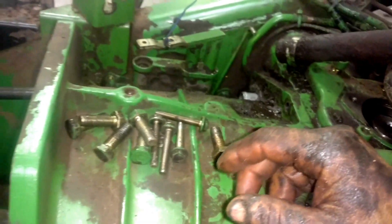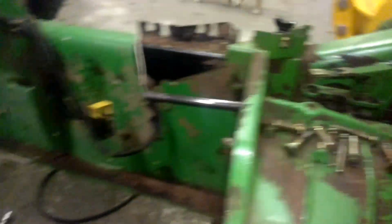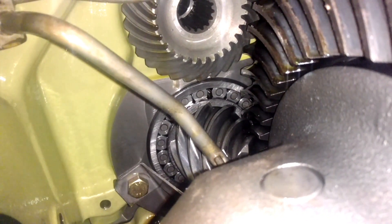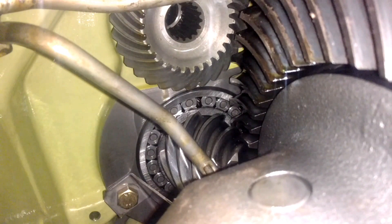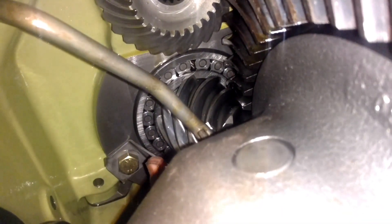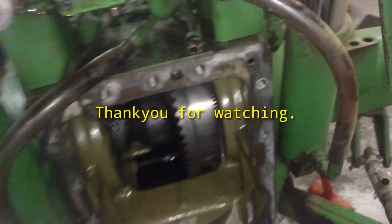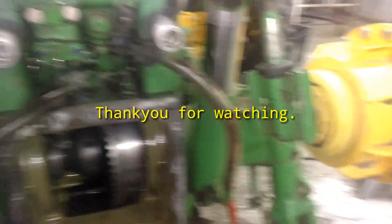It's about 8:30 at night and I've had enough. Come back Monday and finish tearing it the rest of the way apart — I guarantee it's got something to do with the pinion bearing. Because if you look up in there, see how the rollers are all touching each other? And then there's a big gap right there in the middle. There's something wrong there, that just can't be right. We'll find out Monday what the heck is going on with it. Thanks for watching.